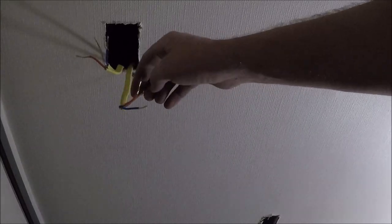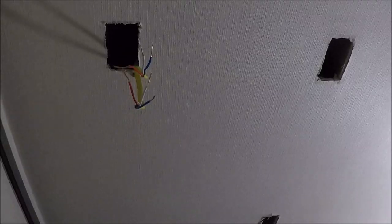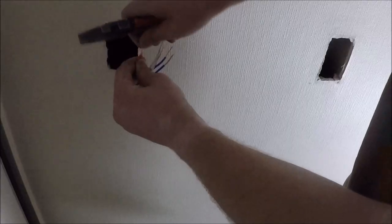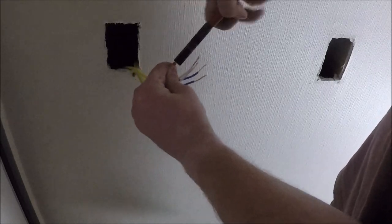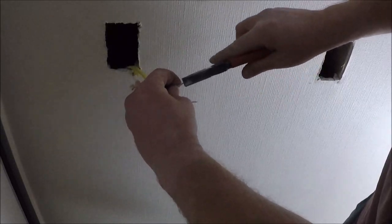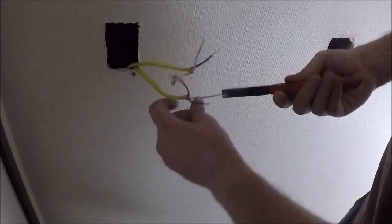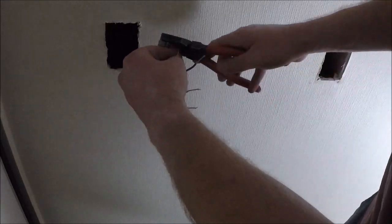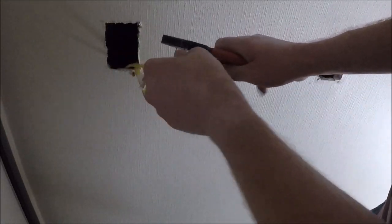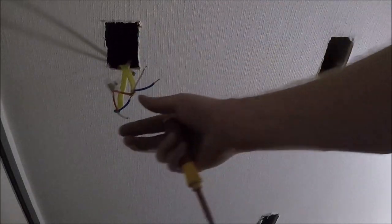What we want to do — find my pliers. Throw the reds together, twist them up, put that in the connector. Twist these ones up — they'll be going in separately. Trim the copper off. So once you've done that, these ones are not twisted together.